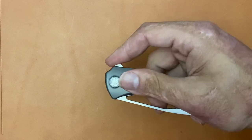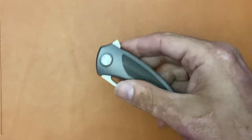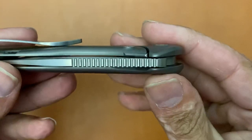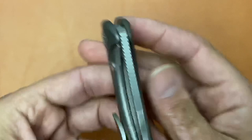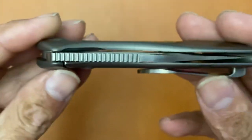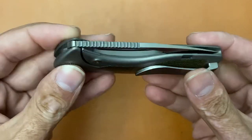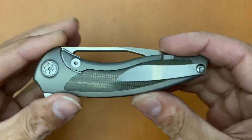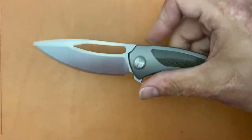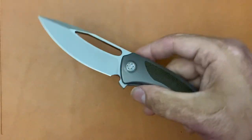Oh, what was that? Okay, something just happened. Let's see. Soft normal close and a soft detent. What is going on here? Listen to this — you heard that click. I'm hoping it's just a blade alignment. Maybe if I push the blade back over this way, it seems like the detent ball is not sitting — it's not falling into the hole all the way. Watch: when it's sitting in the hole, nice snappy action. Then just close it up — and somewhat of a weaker action.